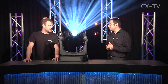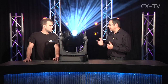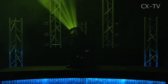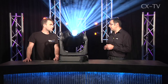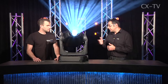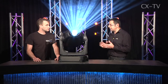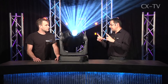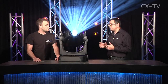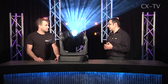Added to that, there's more in the way of gobos — we've got two rotating gobo wheels. Originally the Mac 2000 had two rotating gobo wheels, and the Performance had an animation wheel. There are four models coming out: the Mac Viper Profile, which you see now, is the first; then we have an Air Effects, a wash light, and hopefully early next year a Performance Viper with framing shutters and so on. The current configuration has two rotating gobo wheels plus a static slash animation wheel — half the wheel is static gobos and the other half are animation slots. So you can drift that in and out of the beam, and there are macros to make it go back and forth smoothly to make it easy to program.